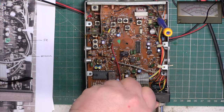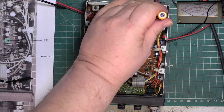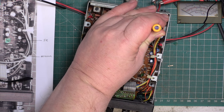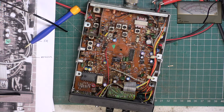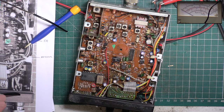It's really low. It really is about 1.5 kHz, just like the Marconi set said. So let's move that up a bit, if you will. That's now peaking at 2.5. Right, we'll plug it back into the Marconi test set and see if it agrees or whether it's in a shan't mood today.